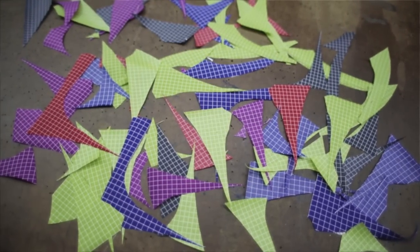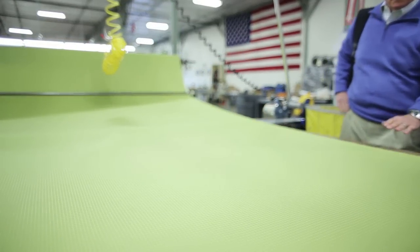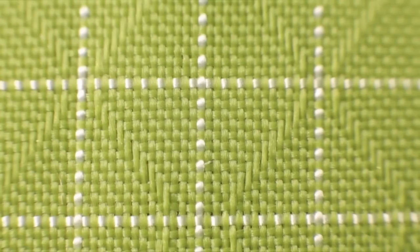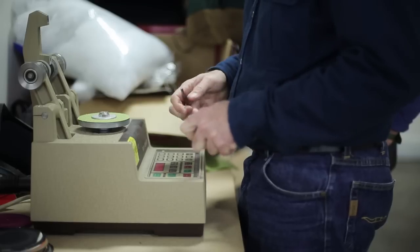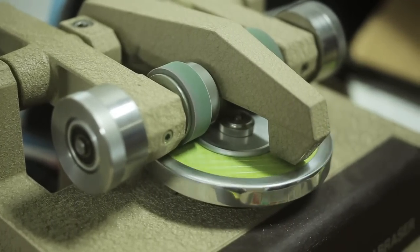The Dyneema ripstop nylon is a much lighter weight fabric made for us in Japan. It's a great lining fabric. It's very lightweight. Even though it's just a lining fabric, it's being sewn directly to the ballistic nylon on the inside of the bags, forming dividers and pockets on the inside of the bag. And those are subject to a surprising amount of stress, especially when you're overloading your bag. We didn't want to have this beefy exterior fabric of 1050 ballistic nylon and then a cheap lining fabric that could tear out on those seams where it's joined to the ballistic.